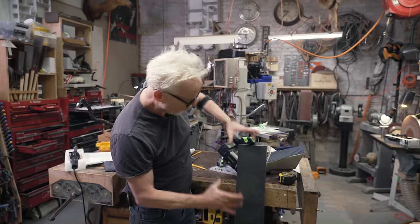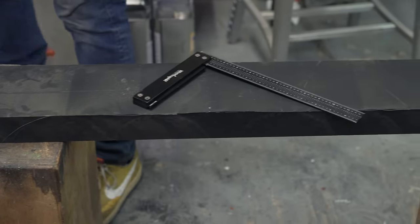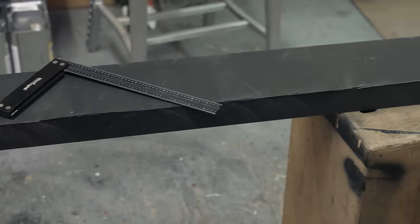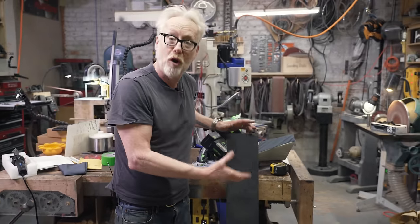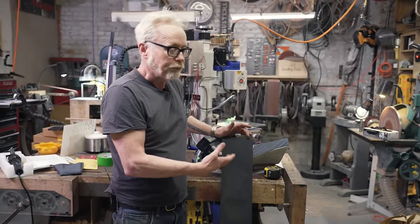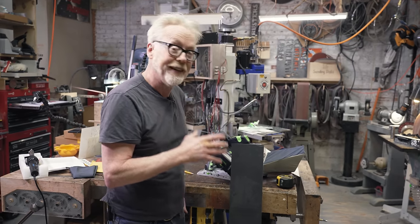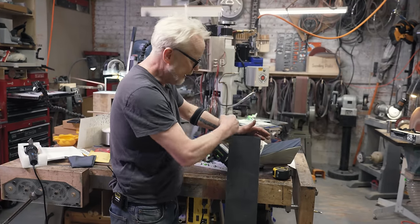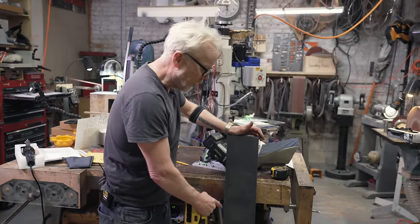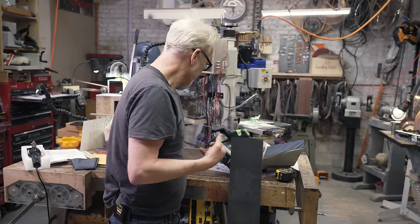It is going to be 12 inches long by 3.5 inches wide, because it has to fit another phone in its base to drive the screen of the phone we'll have in the clear. It also has to fit all the electronics, the power supply, the switch for turning it on and off, etc. So I'm going to slice this down on the table saw, and then I'm going to chuck it into the mill and do a lot of hogging out. Yeah, here we go.